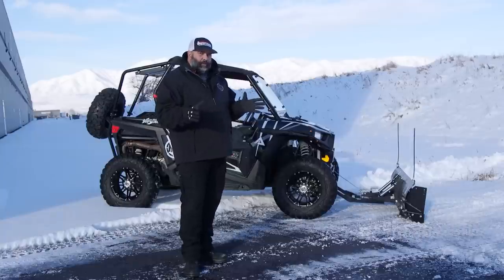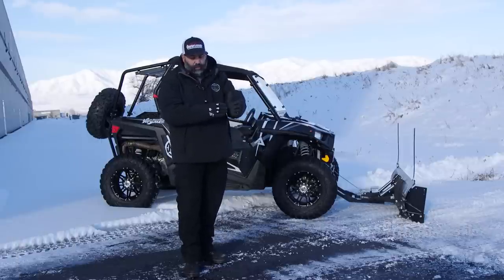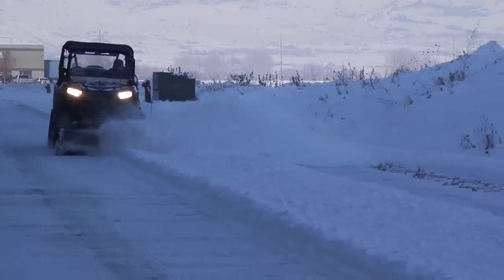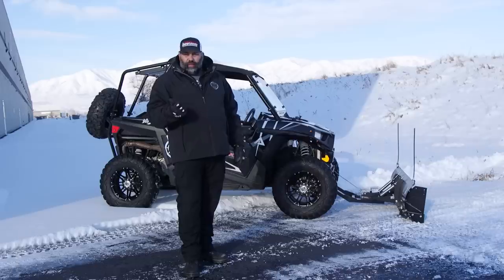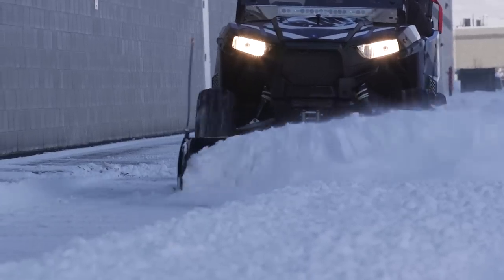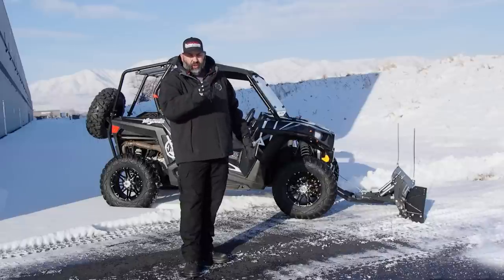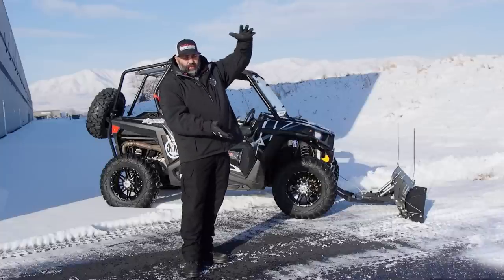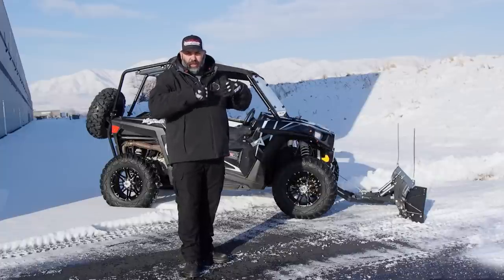To get into those: windrow is when you have your plow blade angled. All the snow is going to roll off the side of the plow and you're going to push all the snow basically from one side of the driveway to the other side and then off the driveway. If you've got a lot of heavy snow, you might want a relief row or two. If you've got a nice long push, maybe it's a little too wide or a little too much snow — you start pushing that snow directly sideways. By the time you get to the edge, you've run three or four times and you've got four times as much snow, plus it's all compacted and heavier, sitting right on that last push that you need to push it off the driveway.